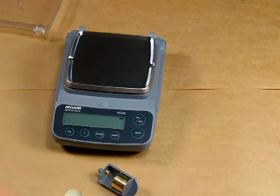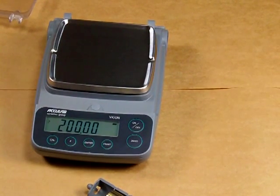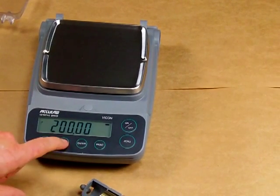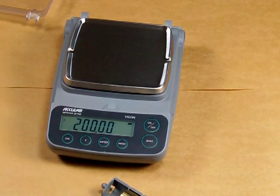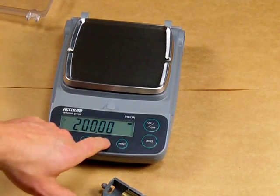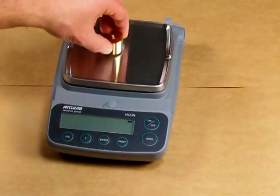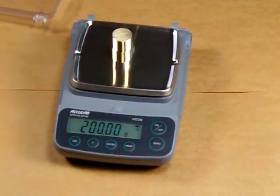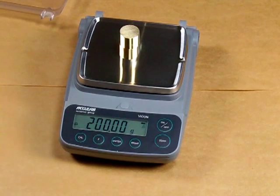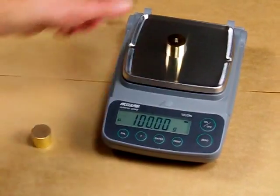To perform a calibration, first zero your balance, then press the CAL key. The balance is set up for 200 grams. You can press the F key to change that — 100 grams, 50 grams — but we want 200 grams. From there, press the Enter key to start the CAL mode; it flashes 200. Take the two 100-gram weights that came with the balance, place them on the platform, and you'll notice the two hanging weight icons on the left-hand side, indicating the balance has now been calibrated. Removing one weight reads 100 grams — right on the money.